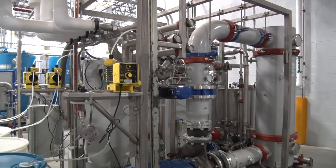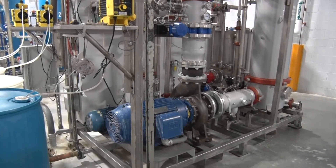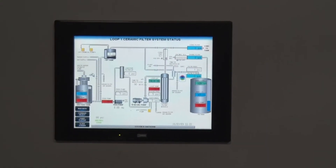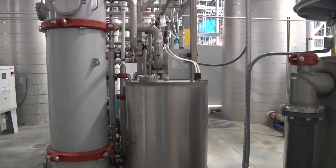As a laundry facility volume grows, an additional Serapure 2.0 filtration module may be added to the base filtration skid. Both cleaning modules may be operated and/or cleaned separately or operated in tandem. The add-on filtration module would be controlled by and cleaned with the existing control panel and automatic CIP element cleaning system.